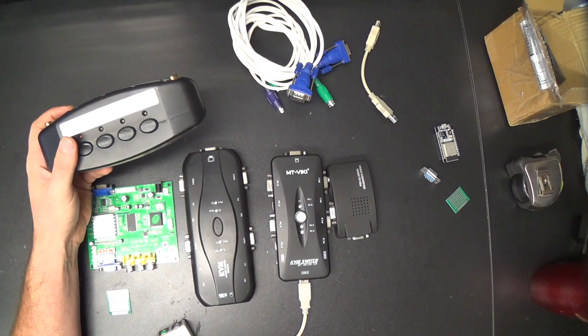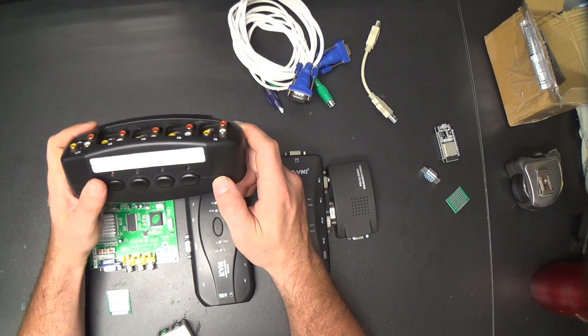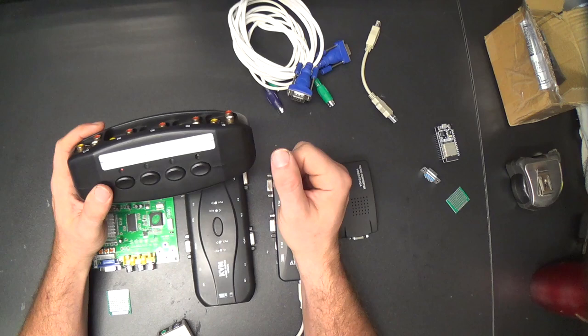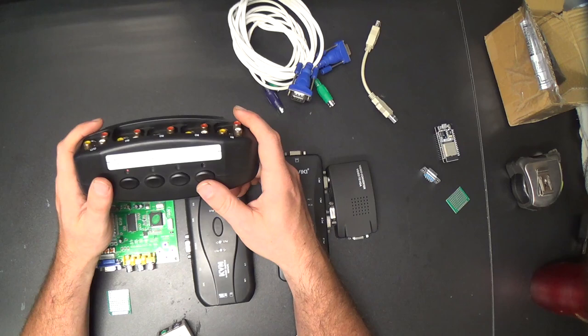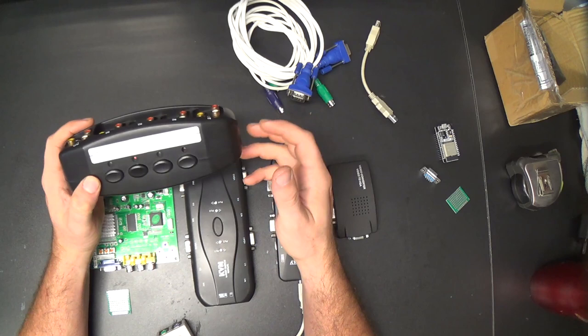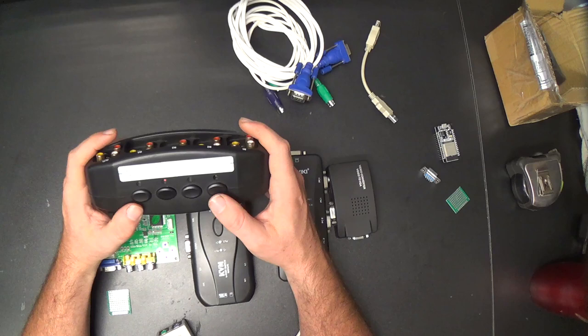I think what the problem is, these ADB ports have this inductor on them. I think it's just there to block RFI, but I wouldn't swear to it. And you know how inductors work. When you switch off power to them really quick, sometimes they spike in the opposite way. So I assume that's what happens occasionally when you hot plug these things. You get a spike through that inductor somehow, if the signal level is just right at the time. The inductor's not on the power line, it's on one of the signal lines, but I assume that when the signal level's just right, if you hot swapped it, maybe it would cause a spike through that coil and mess something up. And apparently it doesn't screw up the ADB interface chips, it just burns out that coil and you can just make a new one and fix it, but it would still be annoying to have to do. So, I'm not quite sure what to think about that.